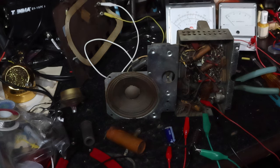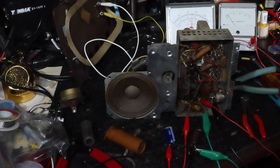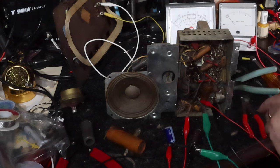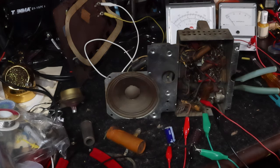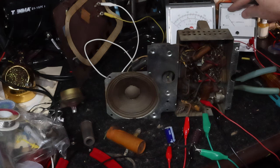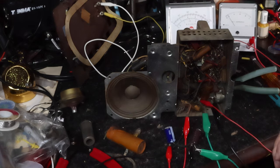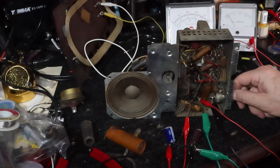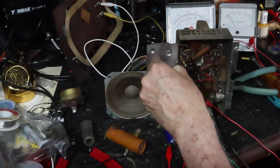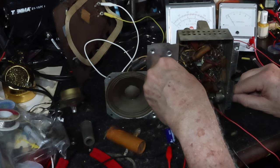I need some of these to help me out. Okay, let's go. Voltage down a little bit. Up. Oh, saw that big spike here. And then we go on in. We know we're up higher, so let's go to 110 volts. And we wait for the tubes to warm up. Go ahead and take it to 115. There we go. So we have sound. The tuning capacitor is hard to turn.